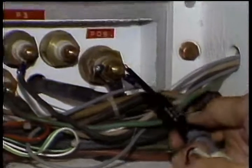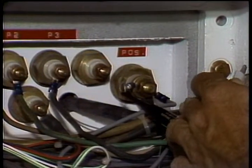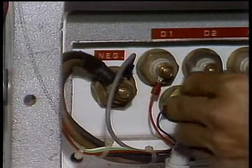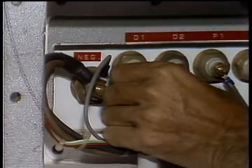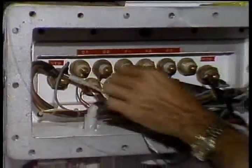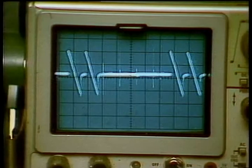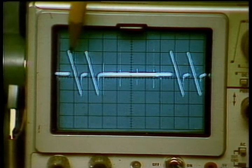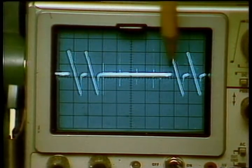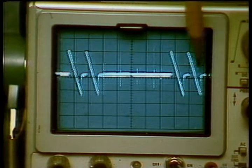As a final check, put a scope across the DC output terminals. Be sure to set the scope on a range that can handle 240 volts. Test with the power selector in each position and the driller's control full on. You should see 6 distinct, equally spaced pulses. If there's an obvious gap, 1 or more SCRs are not firing.